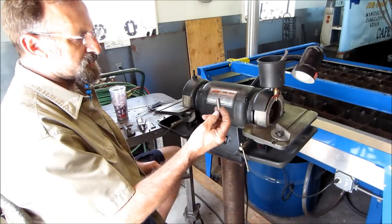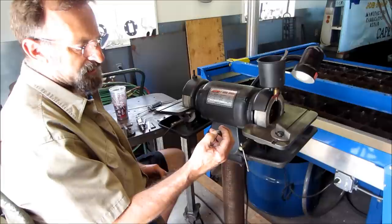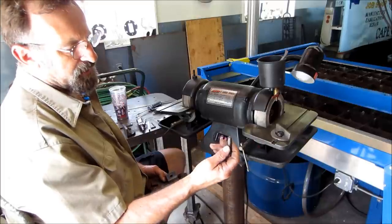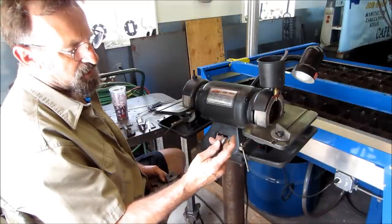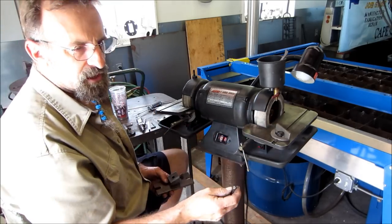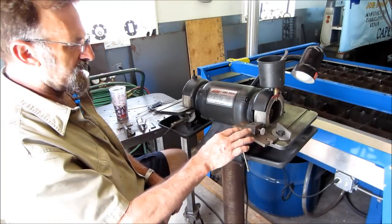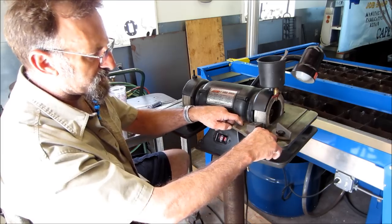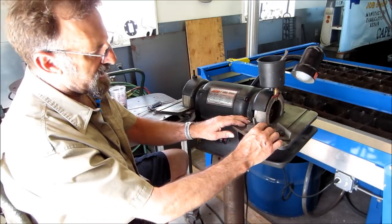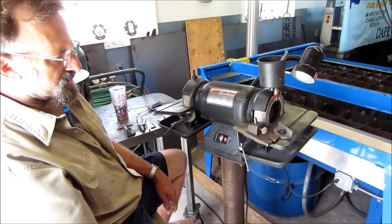An industrial diamond is a very crude diamond, and it's mounted into a round diameter. This is a half inch shank here, and the diamond itself is what you use to dress stones such as this, or like surface grinders and stuff. Here's a homemade plate that sets on a surface grinder. It's either toe clamped down or drawn down with the magnetic table, and the bit sits in the bore there, and the thumb screw locks it in there.